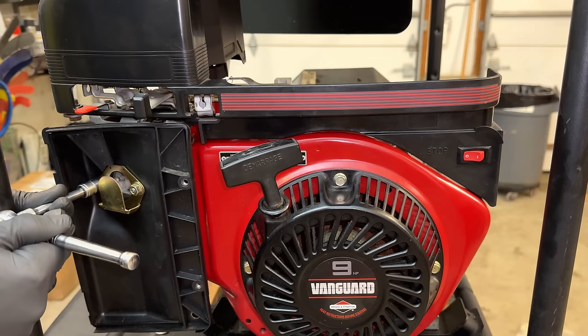It's amazing the difference an OEM carburetor makes. This time it sounded perfect. That engine was rock solid steady. And that actually is kind of surprising because the overall jetting in this carb, it is jetted richer than it was in this clone carburetor.